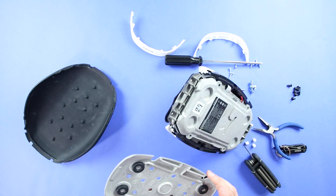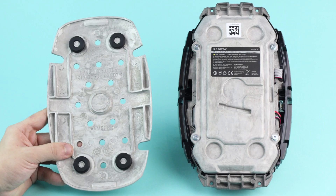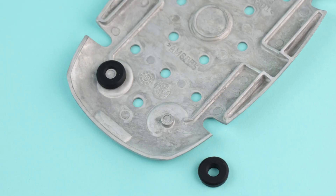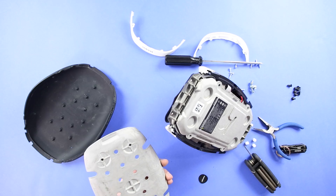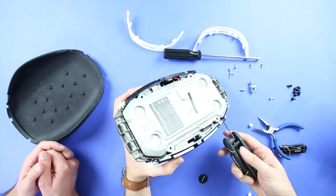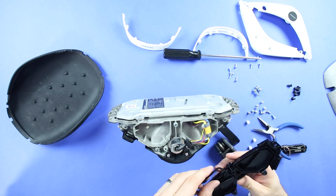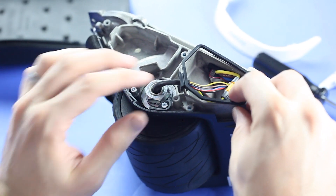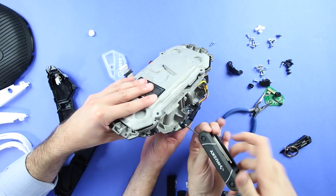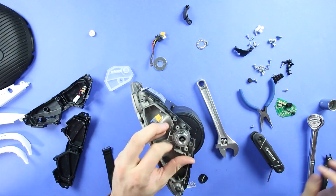Here's a very simple, inexpensive part done in magnesium casting with these four very inexpensive rubber grommets, but clearly put in there with the intention of reducing vibration and long-term riding fatigue. So maybe this actually is a last-mile solution, not just a toy around the house. This is meant to be somewhat water-resistant. This is a sealed connection box. More and more I'm seeing that you would not go through this design effort if you did not say, yeah, someone's going to ride this through a puddle. This is not just for your living room.